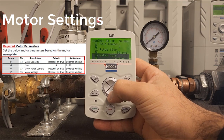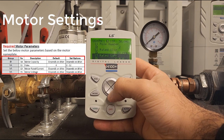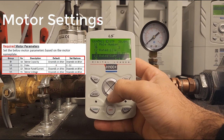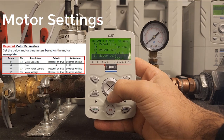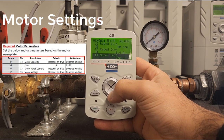These are some additional motor parameters. Next we have the rated current at 6.4 amps — that is correct; another term for this is full load amps. Next we have motor voltage at 230 volts. Again that is correct — this is the incoming voltage to the motor.